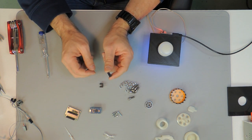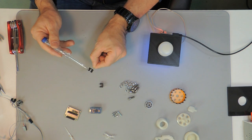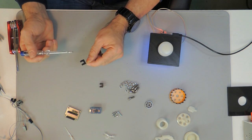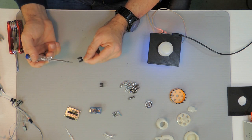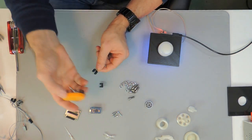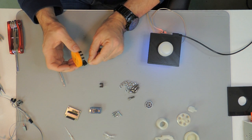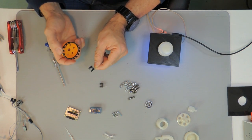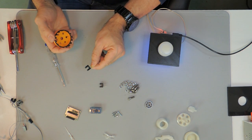If they are new to you, they basically consist internally of an LED on one side and a phototransistor on the other side. The way it works is that once it's installed, when something goes in between the LED and the phototransistor, it recognizes the interruption of light and gives an electronic signal. And this is what we use together with such an encoder wheel. Once it is installed, the encoder wheel gets turned between the LED and phototransistor, and by doing so the interruptions get counted and translated into information that is passed over the USB port and gives the software the information it needs to make the game move.